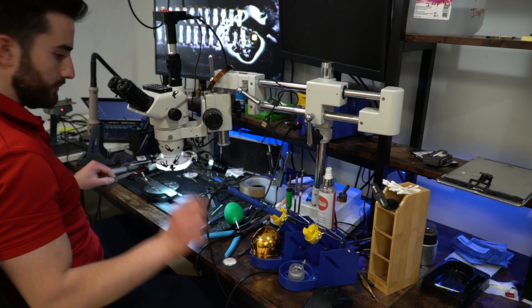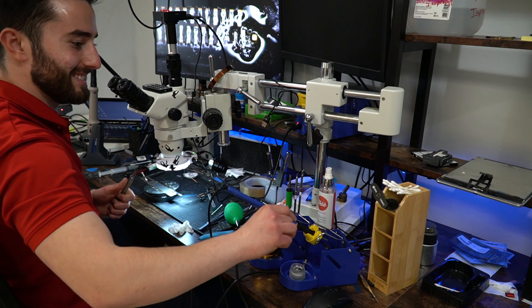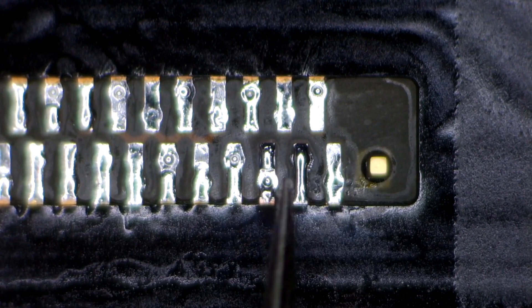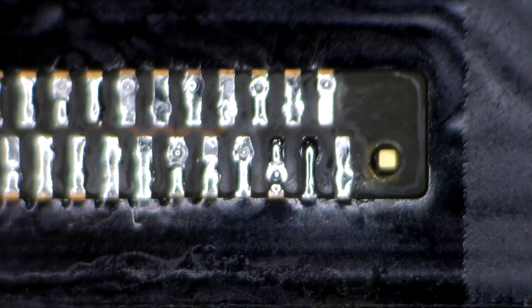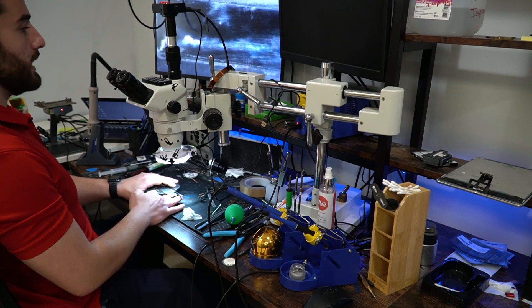Just got to clean it up — and not drop your soldering iron. Double check real quick, make sure the pads aren't moving. And there we go, it's solid. That is a successful charging port replacement. So then I'll just flip back and replace the cover. This is important — you have to cover this up, otherwise it'll touch the metal on the frame and short something out. So make sure to cover that up once you're done. And now you just go put it back in the iPad and see if it works.